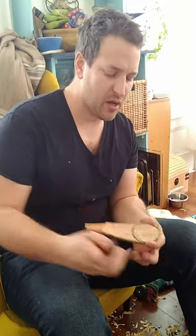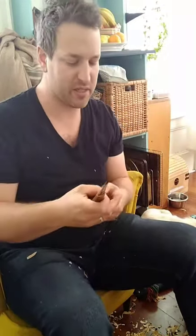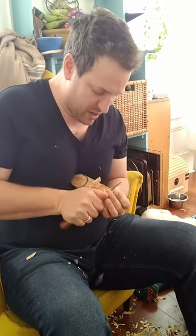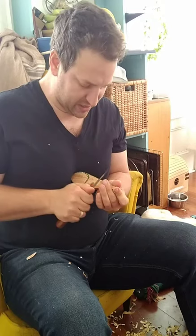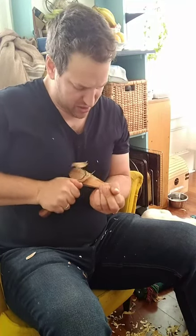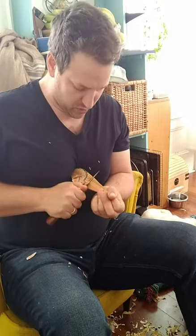And so part of why this is so deep, I don't normally need this, is so that I can increase the crank if I want to. But all of that flows from the tip of the handle. You gotta make sure the tip of the handle is the way you want it. Now, as you get down to this neck, the cut's gonna get harder because you're asking your knife to cut across a whole bunch of wood at once.